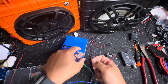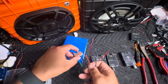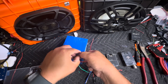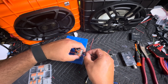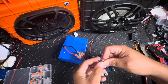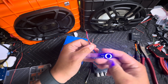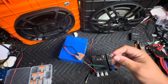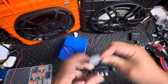We're going to take the green wire and it's going to go in the positive side. We're going to take the negative and put it in the negative side. Now while we're here, we have the positive for the DC input — this is for your charger — and this is the negative. You can see why I used a three wire connector for the negative, because we do have a negative for the amplifier and we want the best ground possible. Now we have the blue and red left. Since we want the LED to cut on when the switch is turned on, we are going to combine these two right here. When I turn it on it illuminates; when I turn it off it goes off. Remember, if it doesn't work this way, check your wiring. You need normally open because when you push this button in you're closing the contact and completing the circuit.